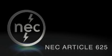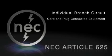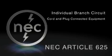The NFPA NEC technical committees are currently working on clarifying NEC requirements for electric vehicle supply equipment, such as individual branch circuit requirements and equipment that is permitted to be cord and plug connected. This is to ensure that effective application of essential code and safety requirements can be applied to all EVSE installations. In addition, it's important to note that local conditions may require amendments to the National Electrical Code. Finally, the National Electrical Contractors Association has developed a National Electrical Installation Standard, NEIS, for installing and maintaining electric vehicle supply equipment. NEIS 413 addresses all safety concerns in addition to important performance and quality aspects of the installation.